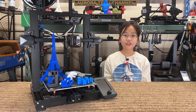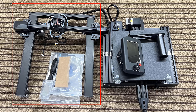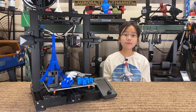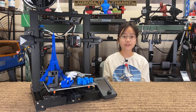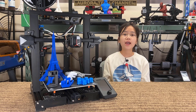Fourth, the print surface: the glass bed has been upgraded to a PC spring steel print surface. Fifth, a one-piece gantry — there's no need to put together the gantry and the x-axis by yourself. Sixth, cosmetic upgrades like the front extrusion slots becoming flat for a better appearance, and an updated screen UI that enables a preview thumbnail. One change I won't consider an upgrade is that all new generation Creality printers are no longer using a Mean Well power supply — this Ender 3 V2 Neo comes with Creality's own brand PSU instead.